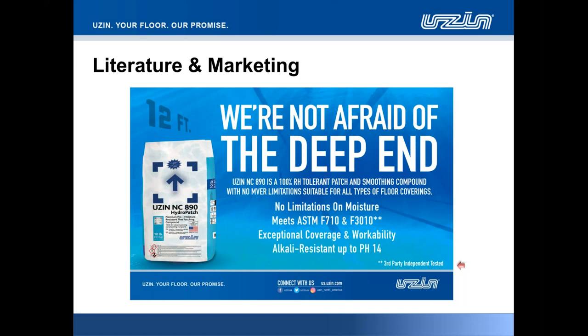Those standard practices actually call for the substrate to have a minimum of 3,000 PSI at 28 days after application. So there is a hard target of 3,000 PSI minimum. And we tested our NC890. It does reach and easily exceed 3,000 PSI when tested per ASTM standards of compressive strength. We also tested the bond strength. It was also very easily reached and exceeded. The bond strength is mentioned for the F3010 standard, where the substrate had to bond to concrete at more than 200 PSI. So that's also easily achieved.